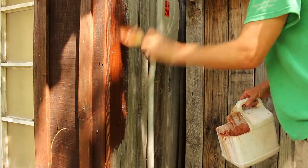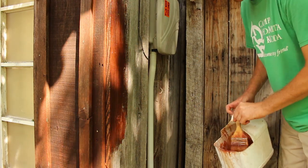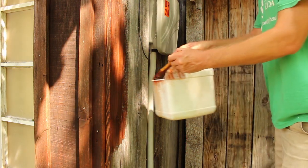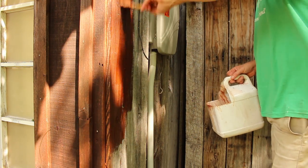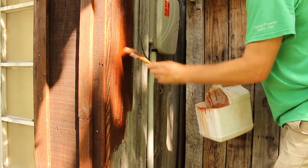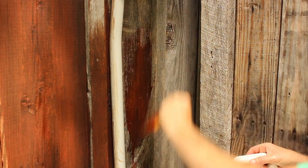The pigment I'm using is just red ochre. This is basically ground up rock, so the pigment will never fade. The oil interacts with it and sticks it to the wood surface. I suspect you could also add some borax to this mixture to make the wood even more unfriendly to mold, mildew, fungus, and insect pests. You could also pre-treat the wood with a borax treatment and then put this over it.